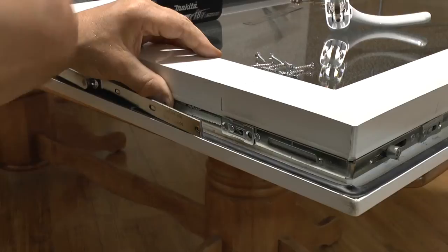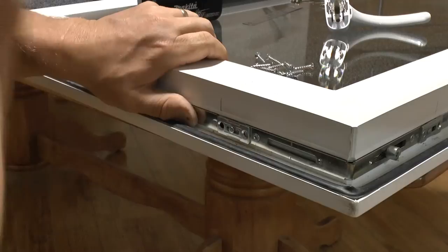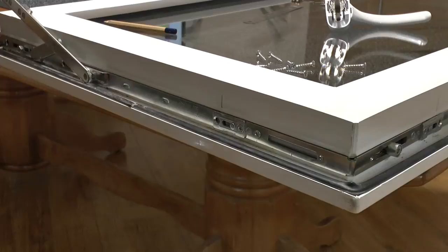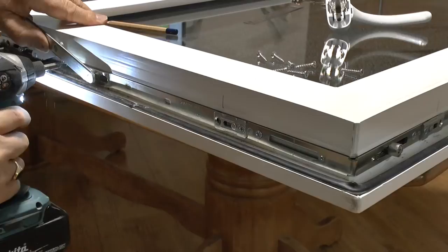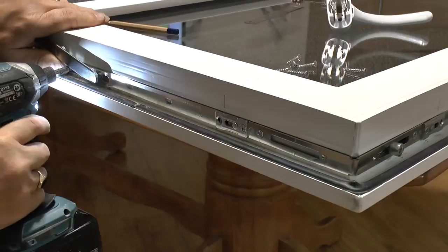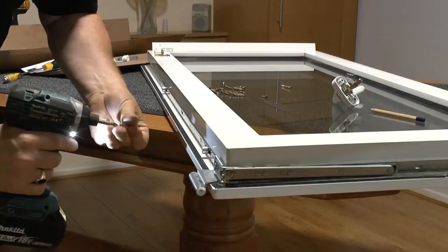And then let the top plate go back, slide the bar across, and then offer screw number one into the plate so it can't come apart, and screw number two. Hold it in, and then there are usually two screws at this point because it is carrying the weight of the window. And that's the scissor stay fitted, and then finally securing all the fixings in the rear hinge side of the window.